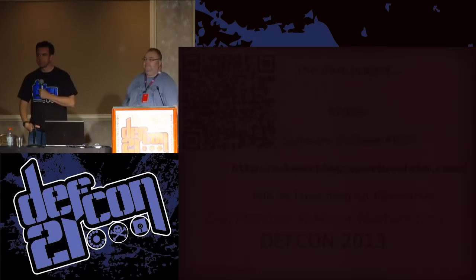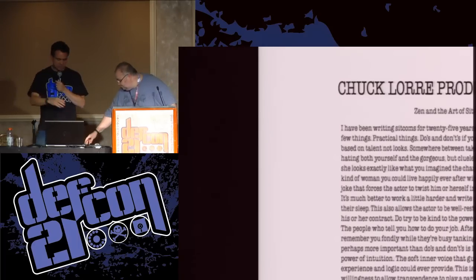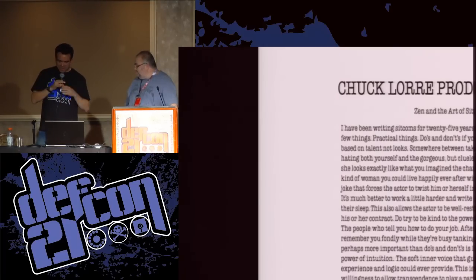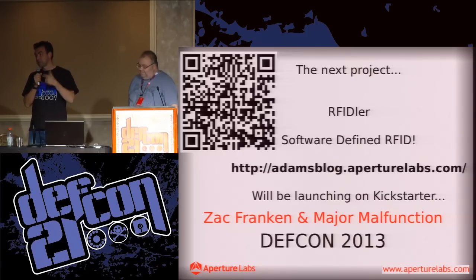Can you poke a running chip to get it to give you the checksum? Or is it only stored in the end, or, I mean, can you get it to calculate the checksum? There is a test routine built into the chip. And in fact, the chips have two chunks of code: the code that the customer put in, and the code that the manufacturer put in. The screen resolution's wrong, so you couldn't really see what that was. But the code the manufacturer put in will check it for you, but it then gets disabled once they've done their tests. Okay. Possibly you could run it with the $25,000 emulation thing, but we never got that.